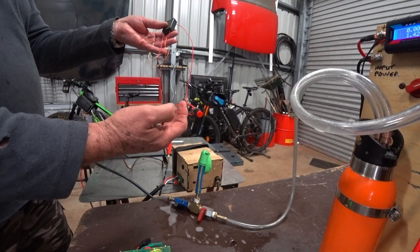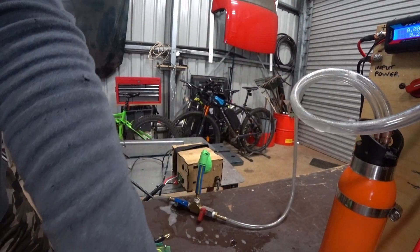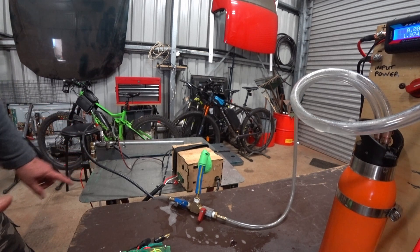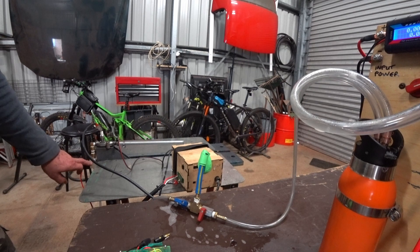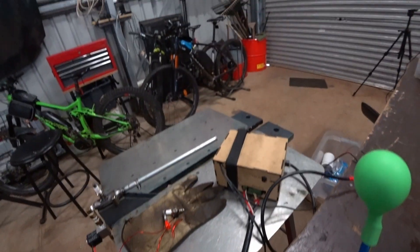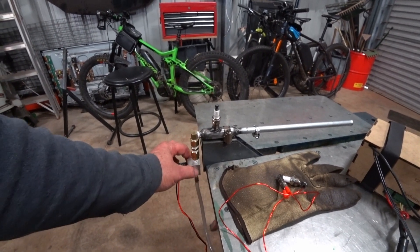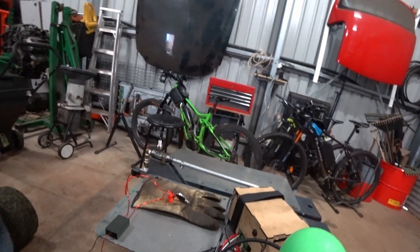This is an eBay high-voltage, high-frequency spark output. I've got it set up with a manual button. What I'm going to do is use it as the spark side and do one pulse with the solenoid, then fire it manually to test the delay — because my delay is going to be more. If it still keeps blowing, it's probably blowing back past the solenoid valve. We have some gas, we have the igniter — it's got a lot of spark. I'll hook that up to the spark plug, and feel the pulse since I don't have an LED set up on this line.